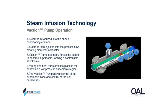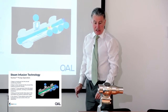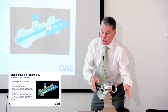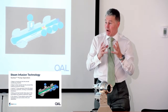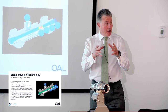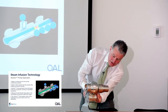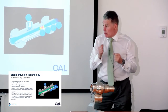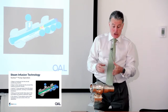How does the technology work? You can see here we have a cutaway drawing of a Vaction unit and it consists of the main body. The steam comes into the steam chamber, which on this device will be at this port here, because this is an in-tank unit. The steam comes down the lance which is mounted within the vessel — it's a double-skinned lance so the steam carries down on the inner surface and the outer surface provides an insulation barrier, so there's no burn-on of the product on the steam lance. It then comes into the Vaction pump, coming in from this direction here, which on the diagram is from position 1. Within this area we have conditioning ports, which condition the steam and raise the velocity, and it then exits from those conditioning chambers into the fluid line.